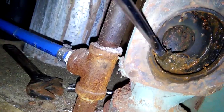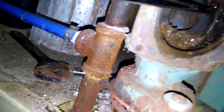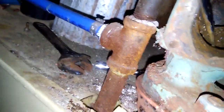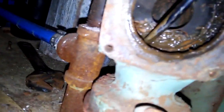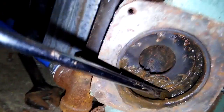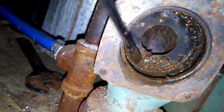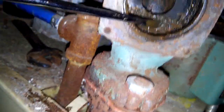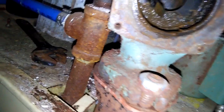Hopefully I got it in time. I'm going to clean all this out — clean the blades a little bit, just scrape it out, get it free, and screw it back in, and hopefully it'll start turning. Just using a screwdriver — I don't know if it's the right thing or not, but I'm just going to scrape away as much of this crap as I can. Sorry for the bad camera work. What happened is this hard water — the chemicals and well water — settled inside the bottom of the impeller when it was shut off and froze everything up.